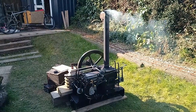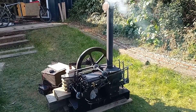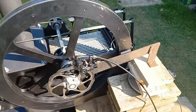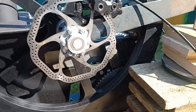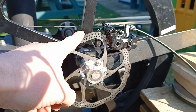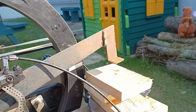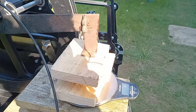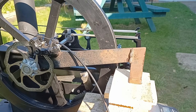We're just waiting for the engine to warm up a bit before the dynamometer run. I'll just take you over the setup of the test equipment. So down here I've taken the drive chain off, so there's no extra drag from the gearbox. And I've attached this device — this is a brake off of a push bike. That bit is turning with the flywheel, and then the actual brake is attached to this lever, which is pushing onto a set of scales here. The scales measure in pounds, and we've got a lever one foot long, so that is going to be measuring pounds-foot of torque.